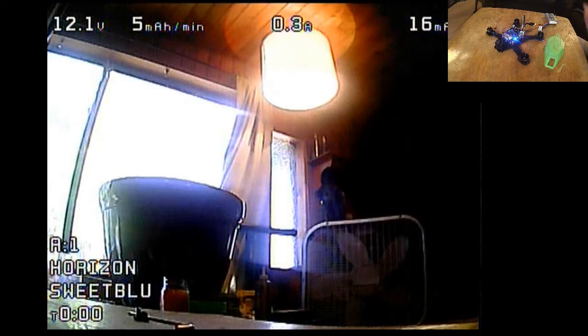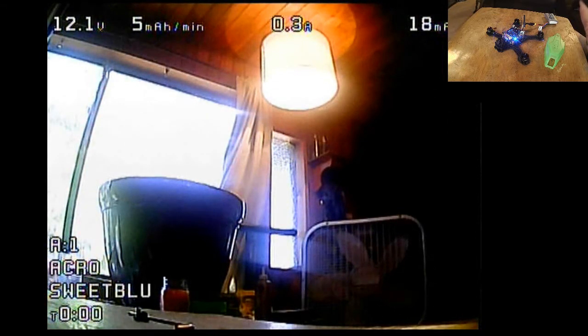Okay it did work — horizon, angle. This is just the default. If you want to change these things you're going to have to go into the flight controller itself and change your mode. This is just what it does by default: it selects angle for the bottom or down switch position (which is two), horizon for the middle (which is one), and acro or rate mode (which is zero) in the up position. That's it, thanks for watching — next up will be a video going through the different options in the OSD.